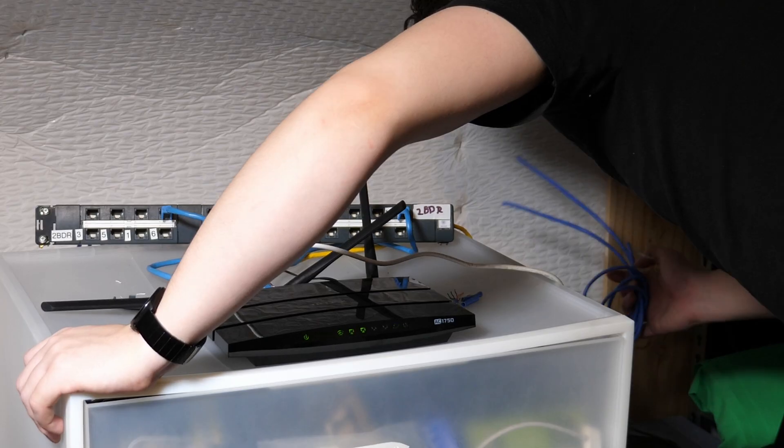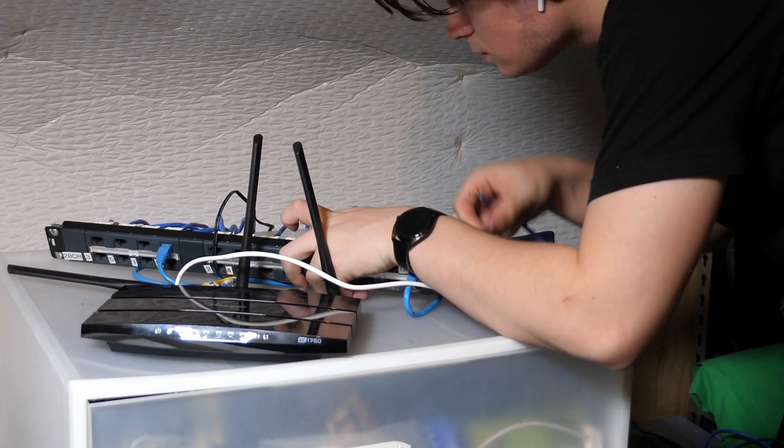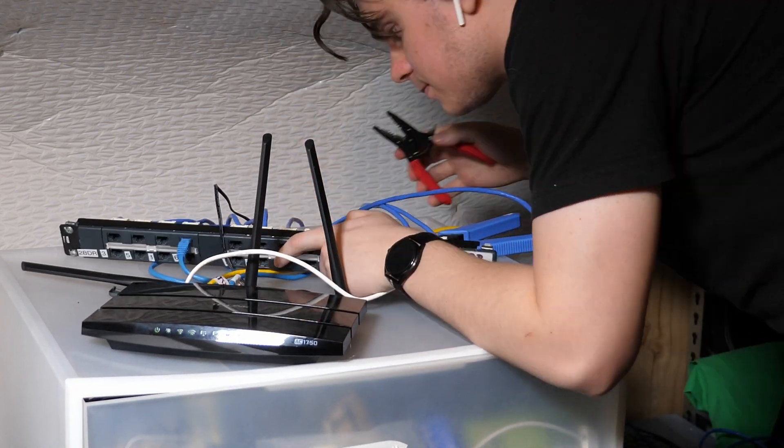The first thing I did was terminate four Ethernet cables up in the patch panel in the attic. I don't think I'll ever need to use these ones, but for completion's sake I wanted every single patch panel and every single port in the house to be working if I ever did want to use them. Ethernet cables generally transfer data at four different speeds: 10 megabits per second, 100 megabits per second, 1000 megabits per second which is also known as 1 gigabit per second, and 10,000 megabits per second which is also known as 10 gigabits per second. A range of factors can determine which speed they run at, including cable type and quality, termination quality, and also the equipment on either end.